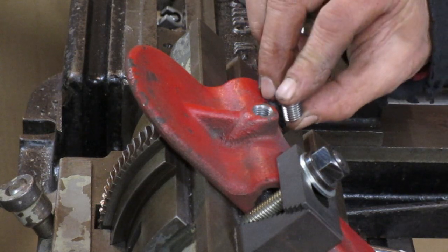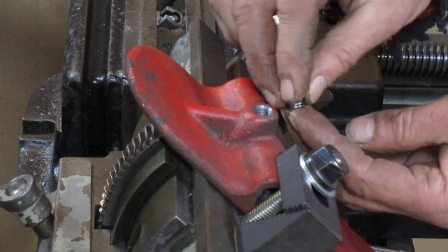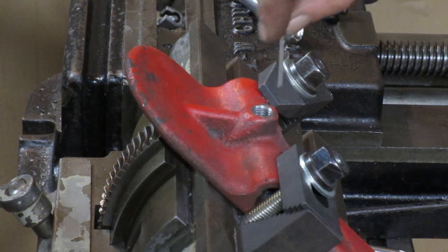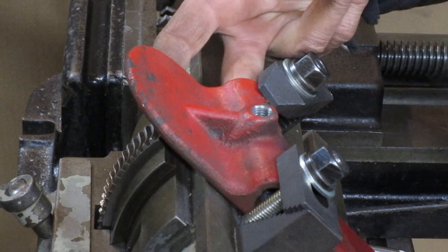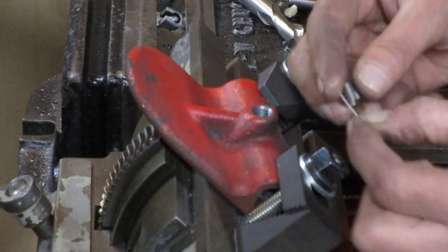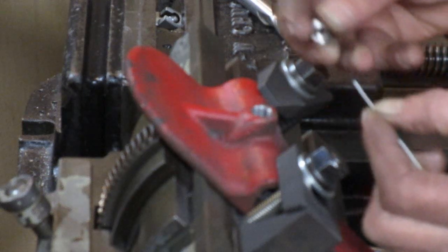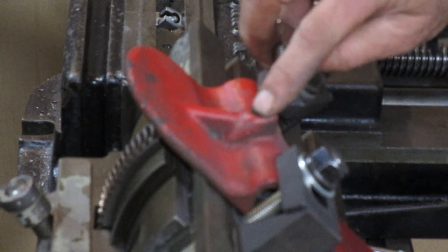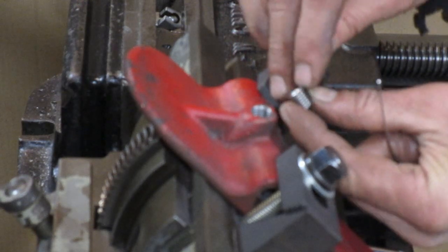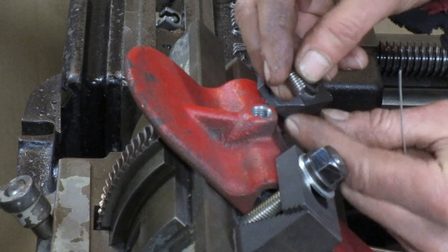You never want your thread insert sticking out the bottom of the hole, so you've got to make sure there's enough material there for that thread insert to be fully contained. If I take a piece of wire and put it down in the hole, I can feel where that wire is, and we can see that wire is a good amount longer than the insert. Now I'm going to lower the insert down below the chamfer, so you lose a little bit of thickness there. If I thought it was going to stick out the bottom, I would grind one or two windings off of the top of the insert before putting it in — that gives you fewer threads in there so it doesn't stick out the bottom.